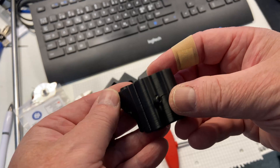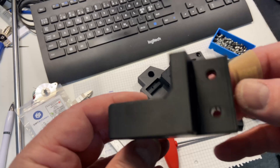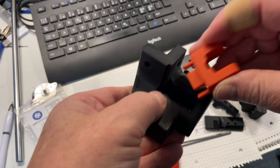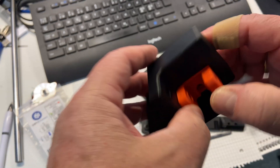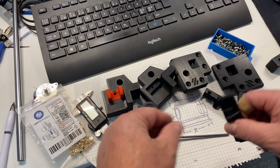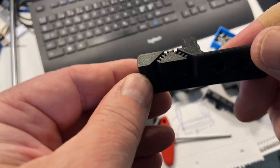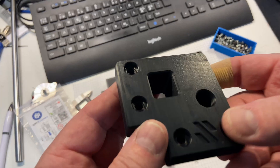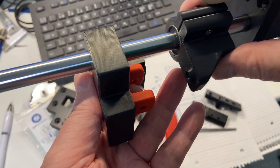I think it's going to be quite nice and I think it will actually work. The parts I designed look really clumsy compared to the original Voron parts, but I think they'll do. This is where the tensioning system for the belt will be — on the Voron 2.4 they use some clamps to attach the belt. I'm going to try out a different system I've been using on some of my other printers, which has been working quite well. This is the lower mount for the left-hand side rod, and the square opening is for the belt.